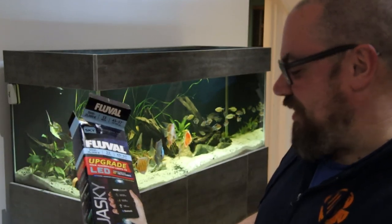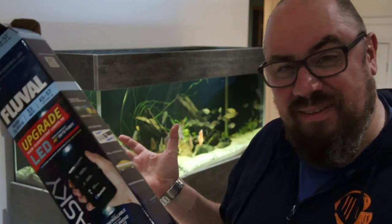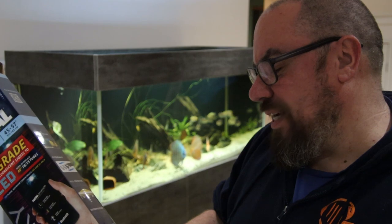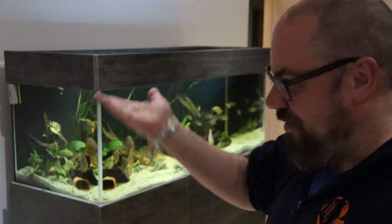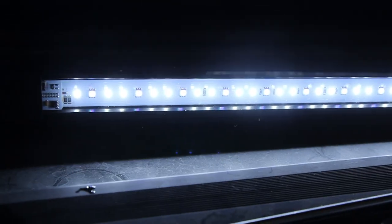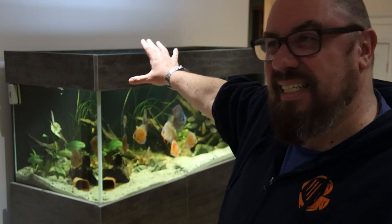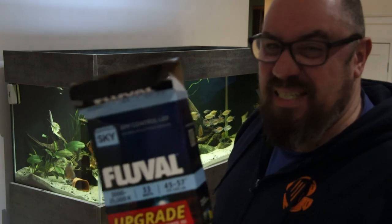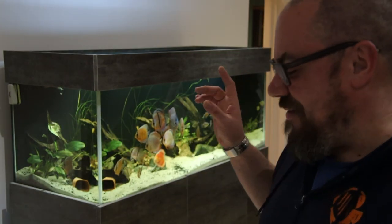It has various other features. This is a light that's controlled by an app on the phone, which can be a contentious issue — it's not something that bothers me, but bear that in mind if it bothers you. It's waterproof, splash-proof, and dip-proof — it's got an IP67 rating, so it will tolerate splashes and short submersions. It's got a 120-degree angle on the light spread, so I guess that's why it's filling the tank more. It's only a single line of LEDs compared to the other lights which are triple lines of LEDs. It's a premium light, so there's an investment — I paid something like £50 or £60 for those old lights, and this is about £120, so it's probably around the same price buying one of these to replace two. Given that it draws a fifth of the power of those two lights, that should let me see some differences in the power bill.